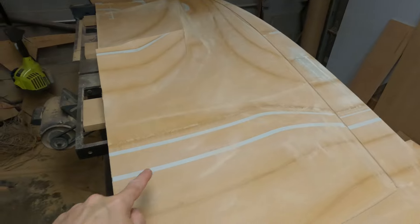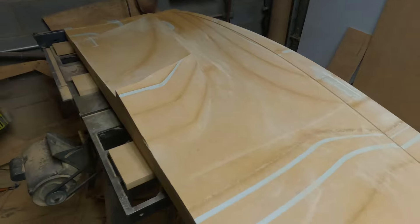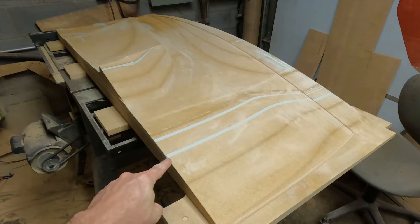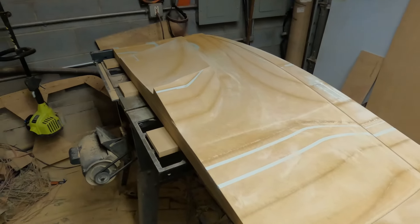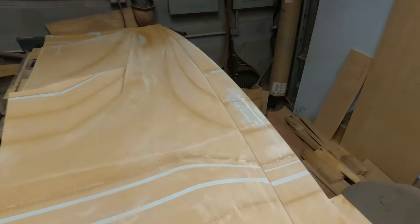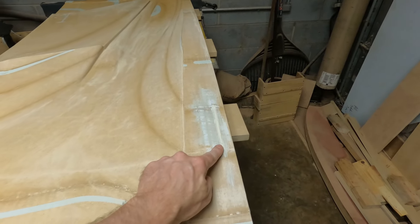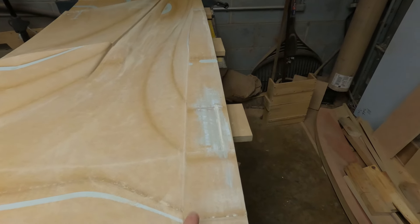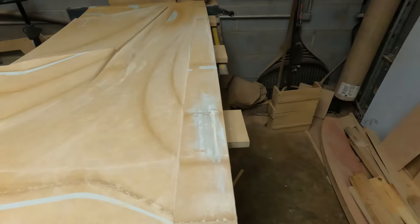You can see some places here where I had to put bondo. I had a tool mess up or break, and when I changed to a new tool I didn't have the z-axis set exactly perfect. So I had some places to fill in with bondo before I ran my finishing pass with a ball end mill. There's also one place where I had an issue with the CNC and the x-axis wasn't moving physically — the machine thought it was, but it was actually just digging in and made a little trench. I'll have to fill that in with bondo as well.